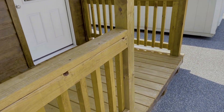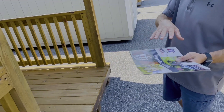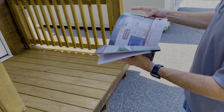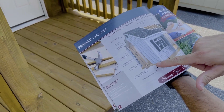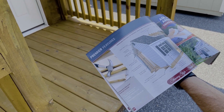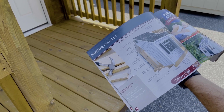So everything has two by six in the floor? Yeah. So I want to give you this pamphlet too. In here it goes through and shows the breakdown of the interior — each style of the building — whether it be the two by six 16 on center floor joists that come in all of our buildings, two by four 16 on center, two by four roof joists.